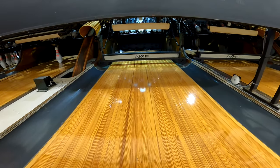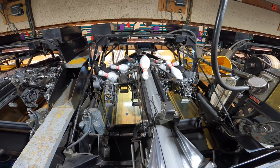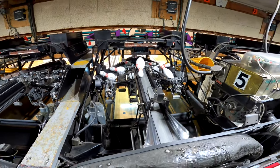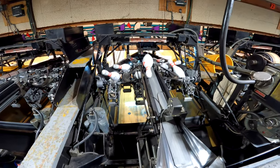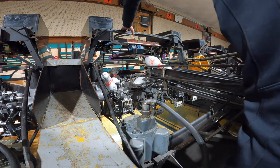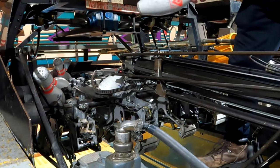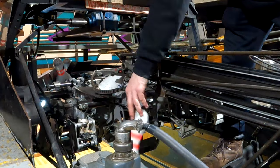The next call is another sweep-down situation. In this instance, the machine has fed an extra set of pins on top of the existing set already in the spotting cups. This is a common occurrence with the clutch modification, or if you have a bad toggle on the elevator wheel. To clear this, carefully enter the machine, stand on the bar, and remove any excess pins that are in the rack.